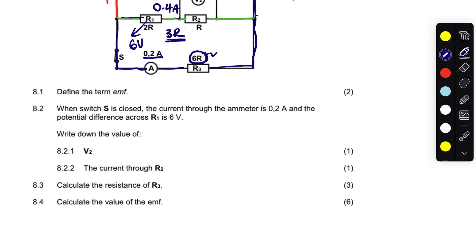So the voltage across R1 is 6V. That doesn't mean R2 is also 6V — it means 6V plus whatever voltage V2 is must equal the parallel voltage. R1 is 2r and R2 is r, so R1 is two times R2. Since voltage is directly proportional to resistance in series, if R1 is two times R2 and its voltage is 6V, then V2 must be half of that — it's 3V.